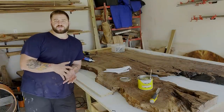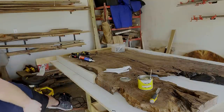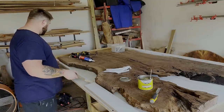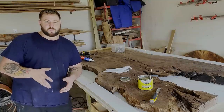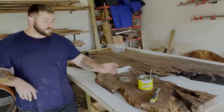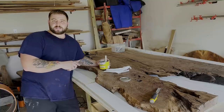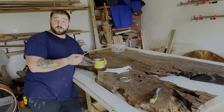I ran out of packing tape and I'm kind of Frankensteining this form together, stacking pieces of melamine next to each other to build out an entire wall. The problem is my typical form release method of using packing tape - I just don't have any. I really don't feel like going to Home Depot for more, so I'm going with paste wax as a form release method. It didn't work great last time, but I think that's because I was inexperienced with it. Now that I've gained a bit more experience, I think I can make this work.